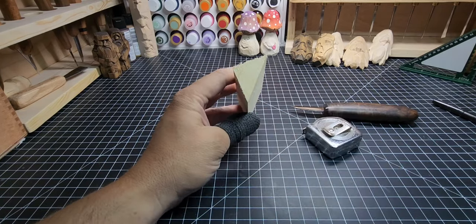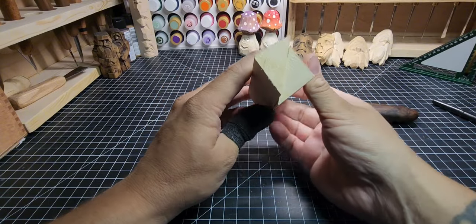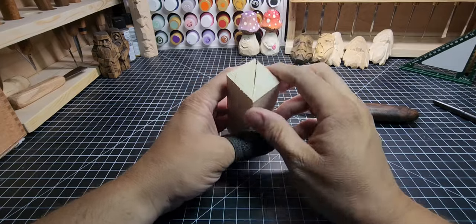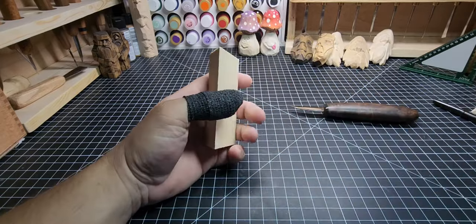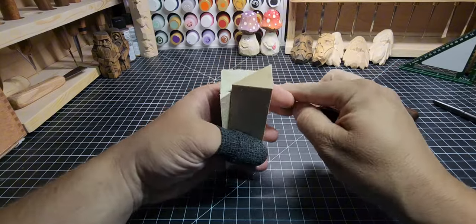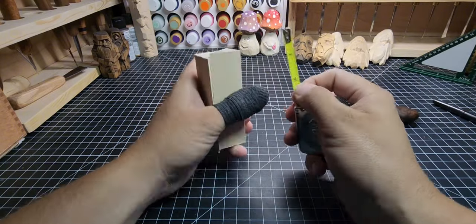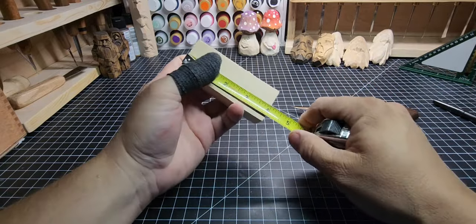Here's another piece for the other side so you can see how it looks. You don't have to cut this on the bandsaw — you could just take a chisel and hit it with a hammer right at the top and split it, or you could use a handsaw. Either way, there's an inch and a half right there. Originally it's a four-inch long block that we're using in total.